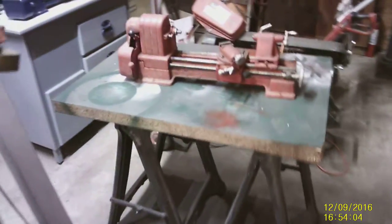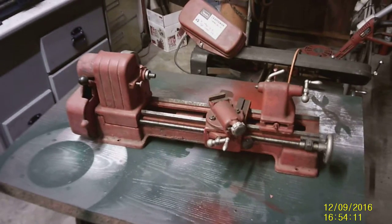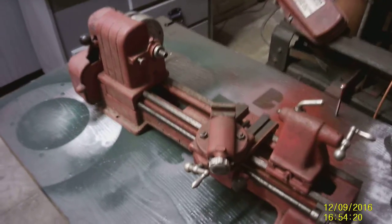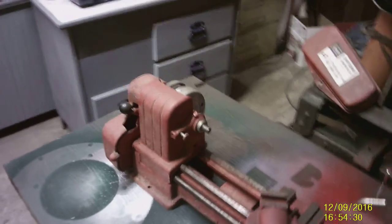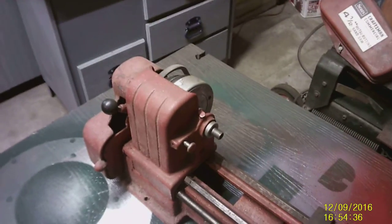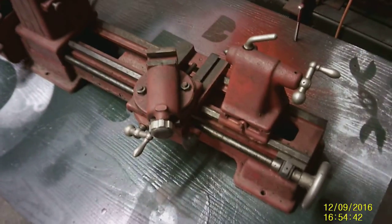Back here they're not Atlas products, but they're cousins. This is a Craftsman 1090206 6-inch metal lathe. It needs cleaned up but I believe it to be in fairly good condition. The ways seem to be good and the spindle's not bent. Most of these little Craftsman lathes, the spindle usually is bent — they're pretty lightweight. But they do a fine job within their capacity.